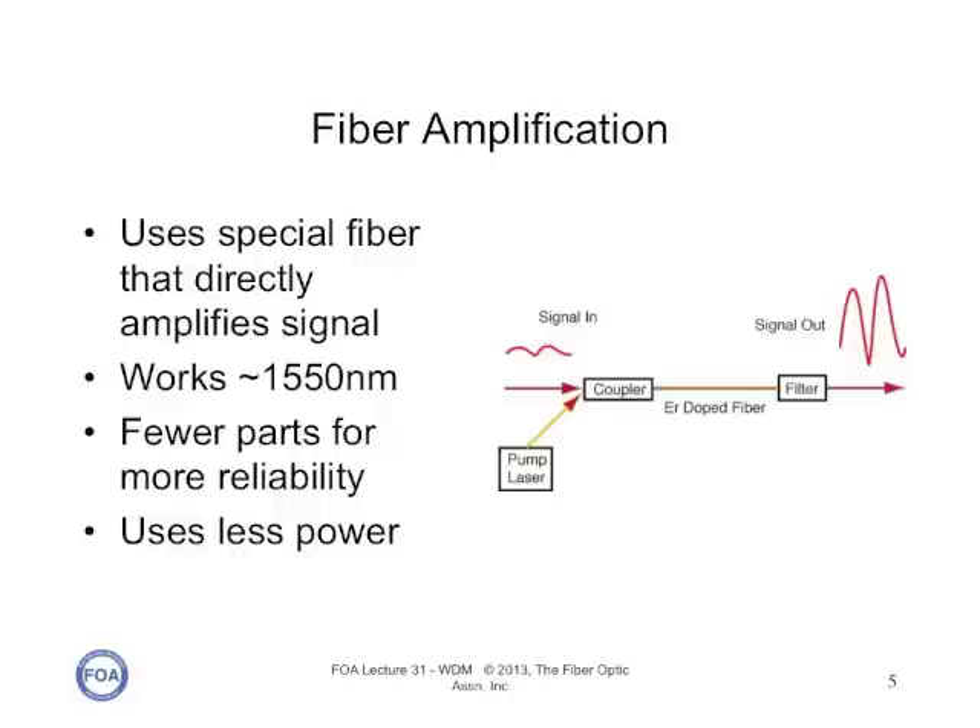This simple diagram here is not the only way fiber amplifiers can be made. The pump laser, which causes the stimulated emission, can be configured in a forward direction, a backward direction, or even in both directions.